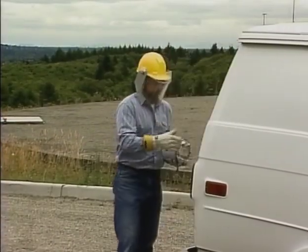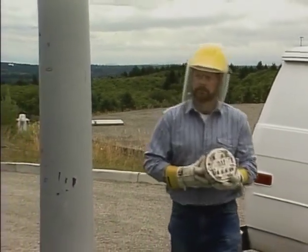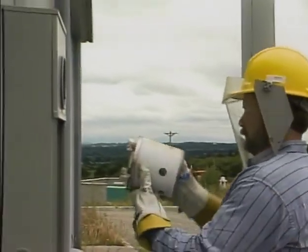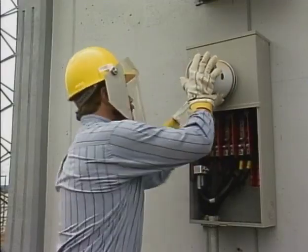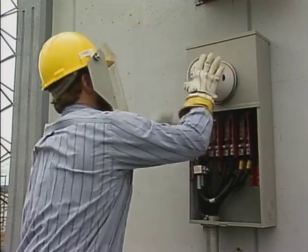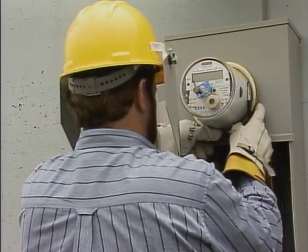All checks on the equipment so far have been positive. The socket has been isolated from any load or power source in the building by the disconnect switch. The socket has also been isolated from the terminations to each phase by the bridging nuts. So the meter technician knows that it is safe to go ahead and plug the meter into the socket and to install the retaining ring.